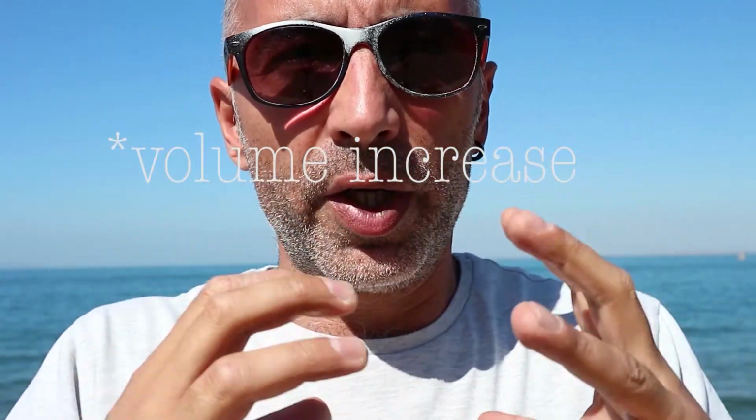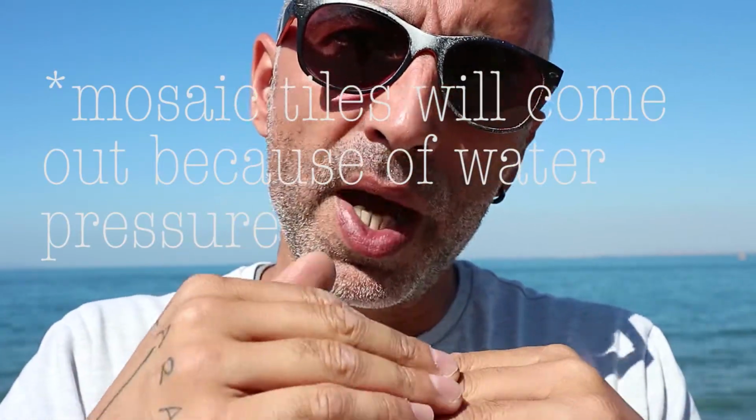Why? Because that water-based adhesive is transparent when it dries, and it turns white when it gets wet again. So that means if water moves under your mosaic somehow, it will make all your water-based adhesive wet again. Water-based adhesive gets bigger when it gets wet, and smaller when it dries. So when it gets wet again, it will stretch out somehow, and your tiles will come off the mesh. You know what I mean? Yeah, with my broken English, you're messed up.